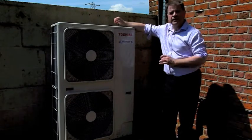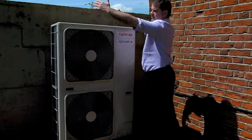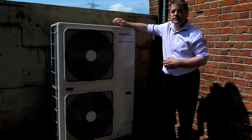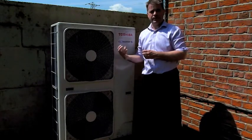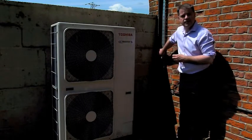This is a 14 kilowatt refrigerant heat pump. We're drawing warm air in the back — and when I say warm, it might be plus five or zero degrees centigrade — drawing it through and absorbing the heat from that air, then putting it into the pipes and pumping it indoors.